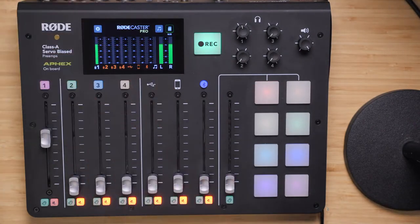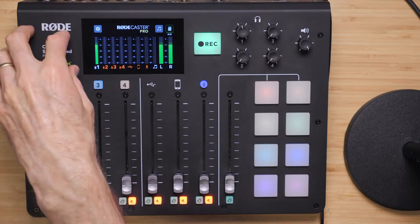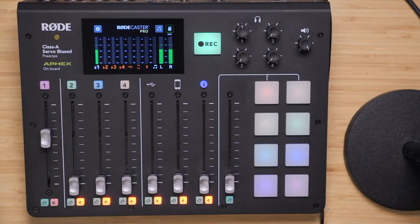I'm curious in the comments what you guys think in terms of how it sounds. I'm hearing a little bit of hiss, but I'm monitoring right here. I think what that's about is that the Shure SM7B is a microphone that requires a ton of gain. Often when I'm using this with another device like a Mix Pre or my Universal Audio Apollo interface, I'll set the gain closer to 60, maybe 61. So we're pushing a little harder here. I'm getting 55 decibels of gain on the mic through the RODECaster Pro, and in the compressor, I'm adding some additional gain, which I assume is digital gain.